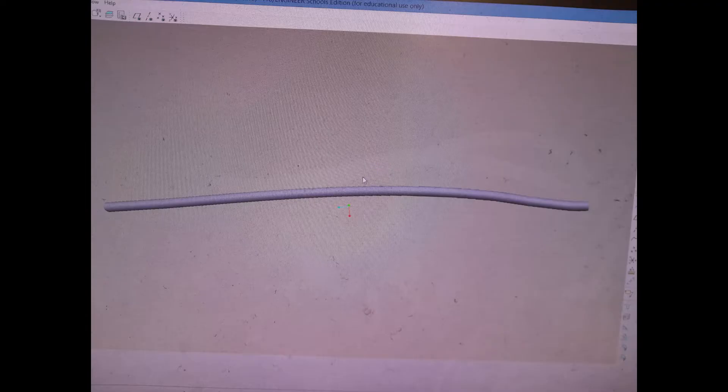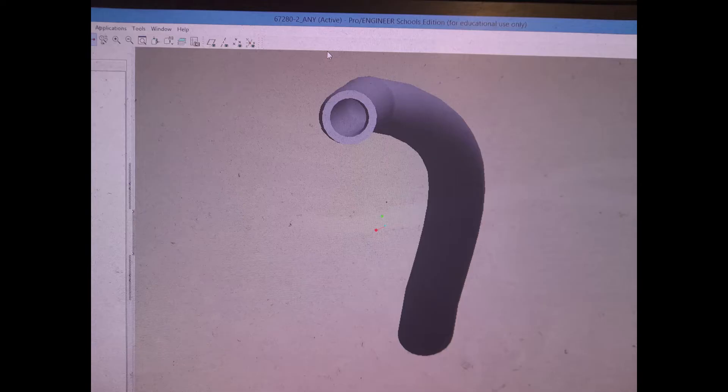The upper longeron was manufactured from a very heavy walled tubular extrusion. The longeron ran from the main diaphragm bulkhead — see update 3 — to frame 10. The longeron was of a complex shape, forming the cockpit opening for the bubble canopy and transitioning to form the contour of the upper rear cockpit structure.